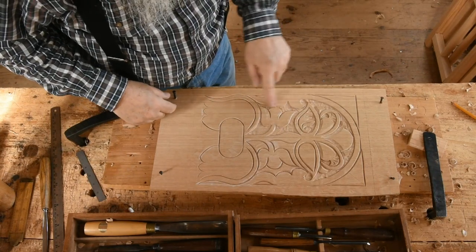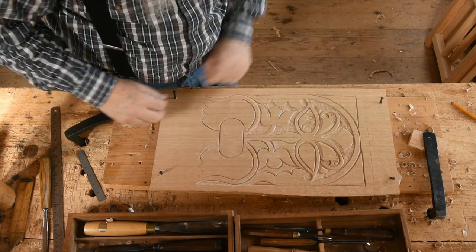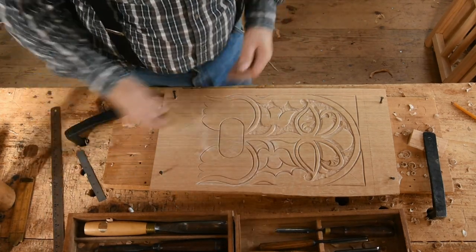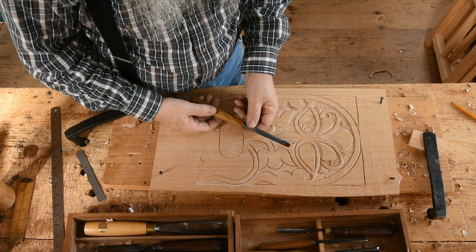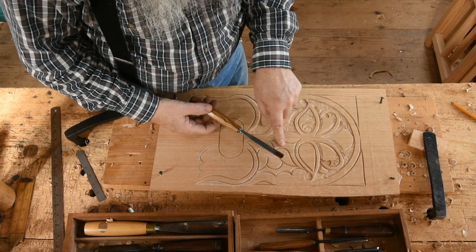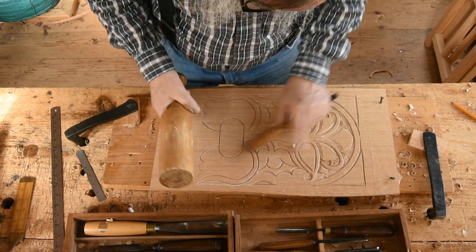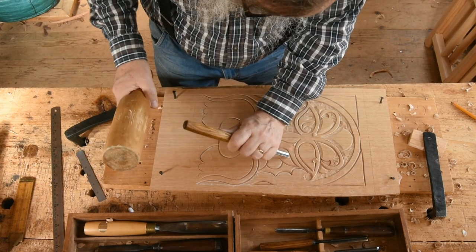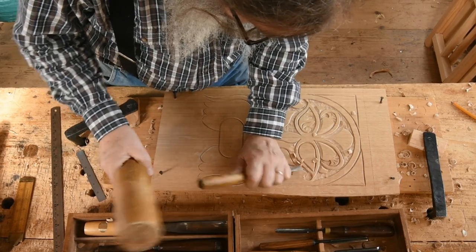There's the background cut out of one side, well above here, and I'll just show you quickly what I was doing there. I tend to almost always use that half-inch wide number five. You can use a wider tool for some of this, but you're not going to save that much time and effort. When I have a bunch of wood to take out, I use the mallet to begin with, catching it between those two v-tool lines and really splitting the wood out.